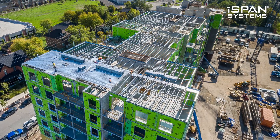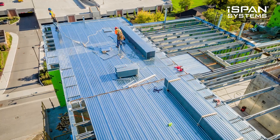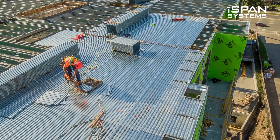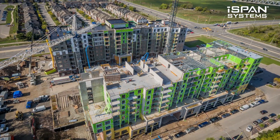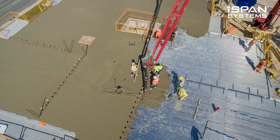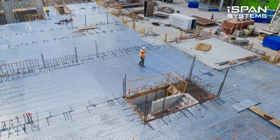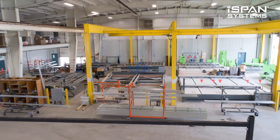It was a very unique product. Typically cold-formed steel is C-sections — everybody makes C-sections. We look at drywall studs: they're C-sections, joist C-sections. A C-section is singly-symmetric, which means that if you stand it, it will fall over, because it's singly-symmetric, not doubly-symmetric, which the iSPAN product is. It was very exciting to work on something that was brand new. There was nothing like that anywhere in the world, and I doubt whether there is today.